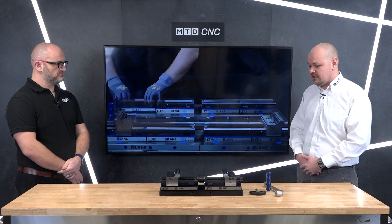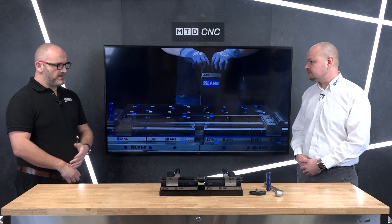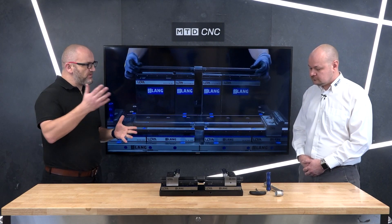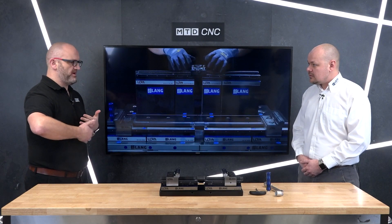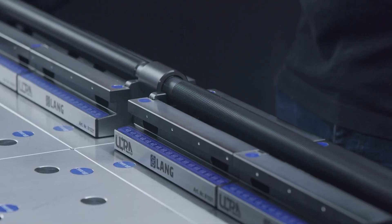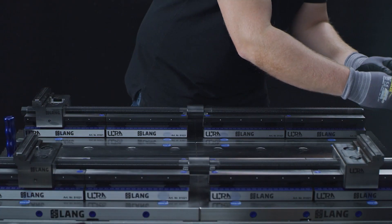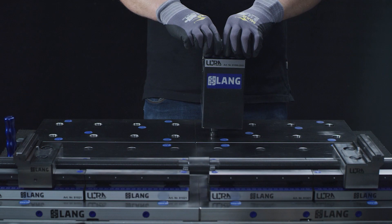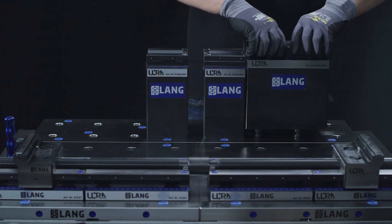So yeah, it's really hopefully going to open up lots of new doors for us. And Lang — you're all about keeping that spindle turning as we say in one of our programs. Does this help? How easy is it to take it on and off the machine, or maybe I'm going from a 200-part to a 600-part or an 800-part? As with all of Lang's products it works off the quick point location system. Once you've got the quick point on the bed of your machine it never leaves the bed, so you've always got that datum point that all of your work holding references to. This is no different — it works off the quick point, so if you want to build up the system you just drop on the vice bodies and they automatically locate within five microns.